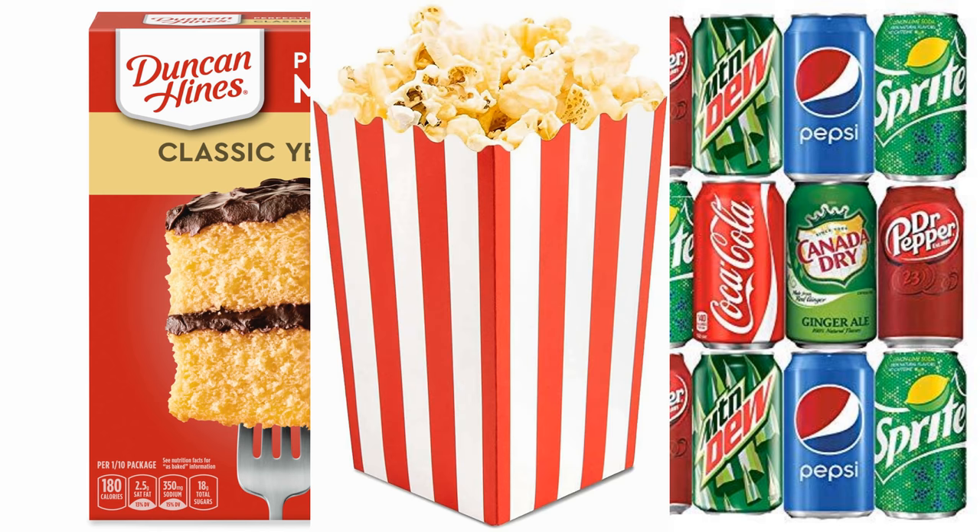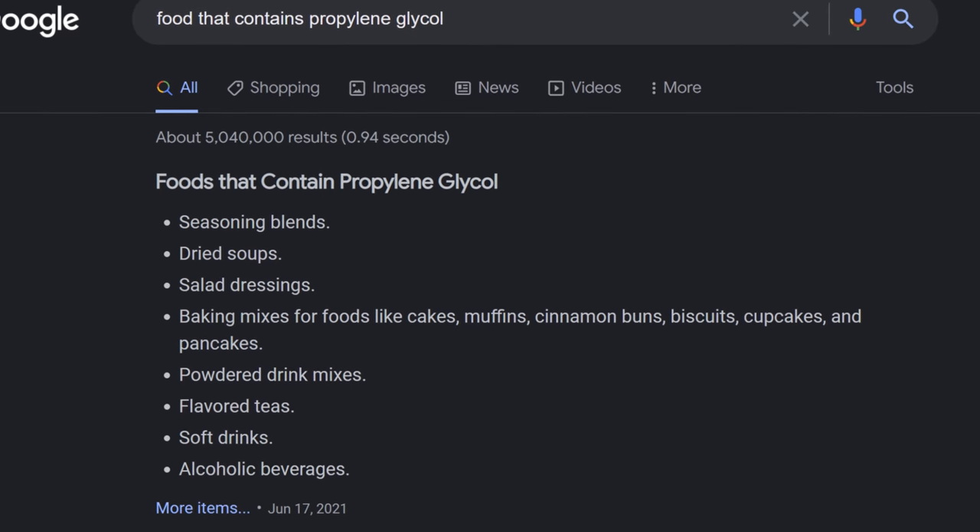Air is probably the only thing on this planet that is not known to cause cancer in the state of California, but I put 'chemicals' in quotes because propylene glycol — which is an ingredient of certain types of antifreeze — is also in drink mixes, dressings, cake mix, soft drinks, popcorn, food coloring, and fast foods. I'm not a chemist, but I do think there is this misconception that antifreeze is this horrible chemical to put in your plumbing lines. And based on the research that I've done, that doesn't seem to be the case, especially since propylene glycol is in so many food products and you're not actually consuming the antifreeze. I'll leave it up to you to decide what is right for you and your family. I will say this: if you winterize with antifreeze, you should sanitize your plumbing system when you de-winterize in the spring. Certain antifreeze products can leave a slight odor or taste in the lines if not completely flushed out, and sanitizing the lines will help speed up this process.